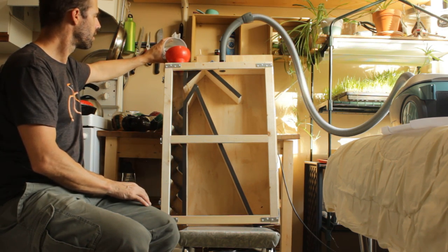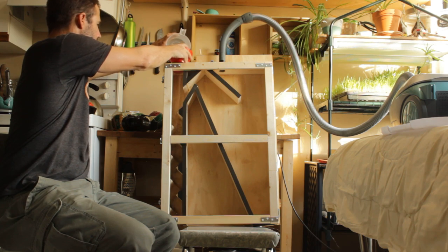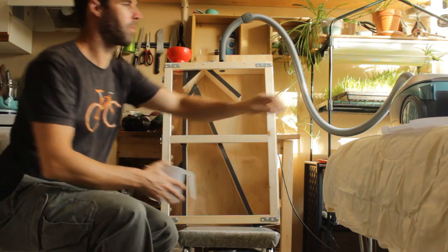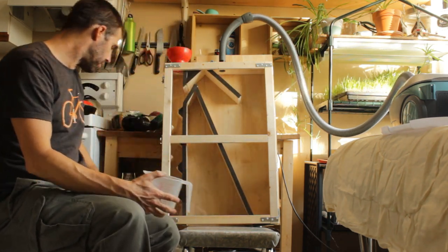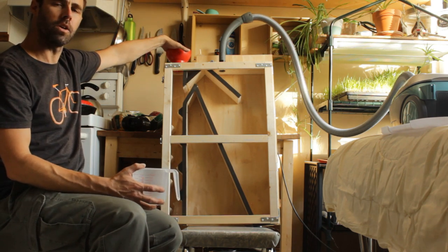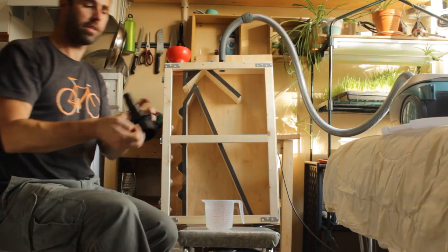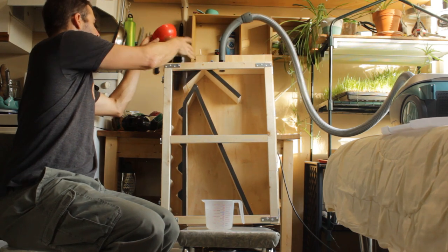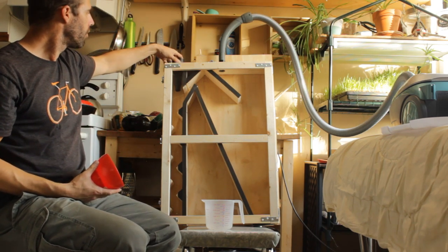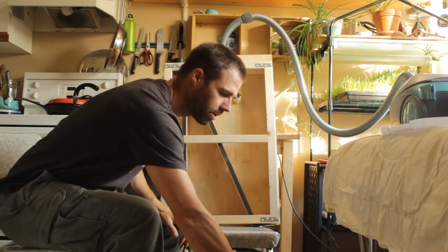You can see the lighter seeds flowing in there. At full suction I've got a little bit of seed in there and I'll take a look to see how it compares. One thing I noticed is I opened this opening here to be quite large and the suction quality went way down — so I can actually adjust that. This is like a vacuum adapter which, if I put it in here, will really reduce that space. The downside is with bigger seed it might get caught, so there are some design things I need to work on.